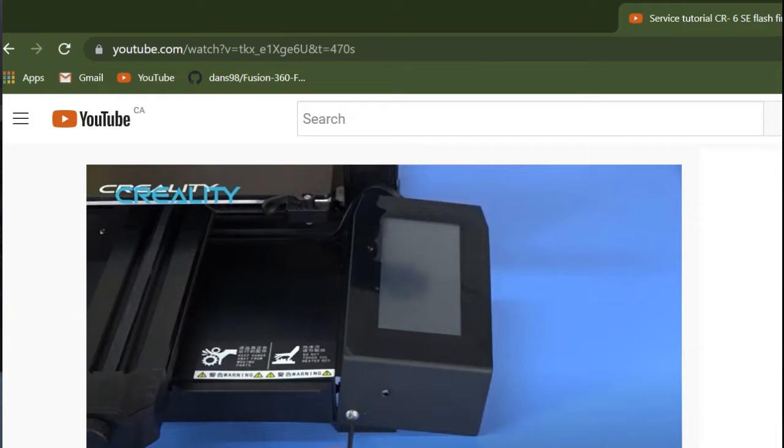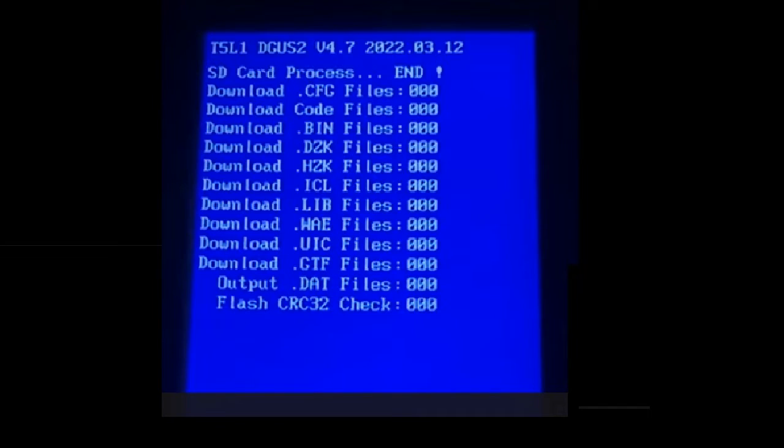Because I don't do that — I have an extender in mine. Come back with an empty DWIN_SET folder on your card, put it in and flash. You'll see all zeros down the right-hand side and across the top. On the blue-green on the top line it'll say DGUS something.